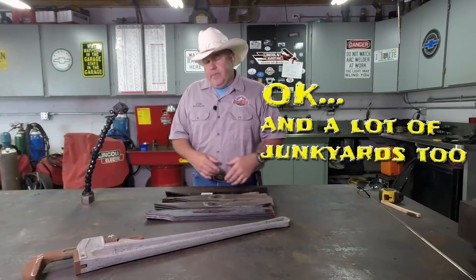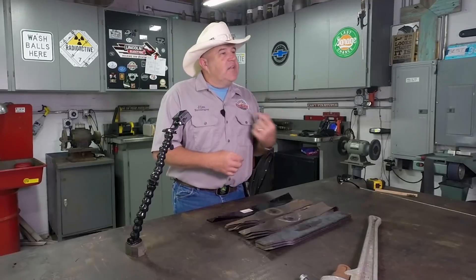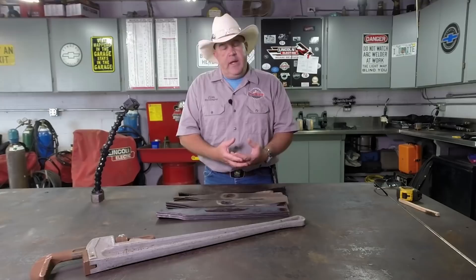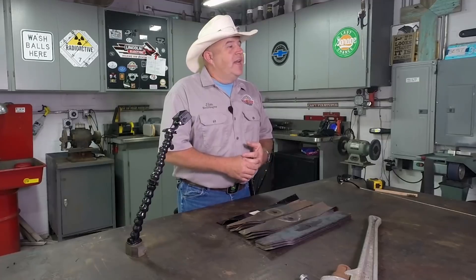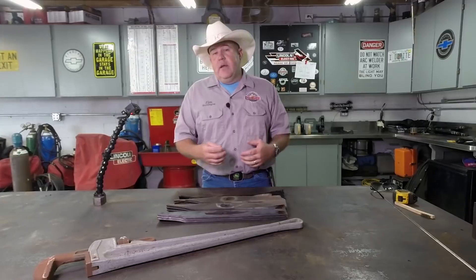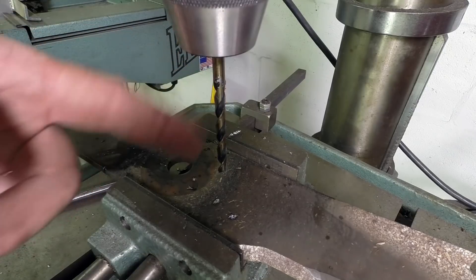Think of a sandblaster. When that lawnmower blade is spinning around, the lift is lifting the sand up and then that blade hits that sand multiple times as it spins around. So for hours and hours the blade is constantly inside a sandblaster, being worn away. In the very first video I reached out and asked people for ideas on the alloy the material was made out of. Lots of people had advice — some said I needed to use a material that can be hardened, case harden the material, or heat and cold quench in oil or salts to make the blades harder.